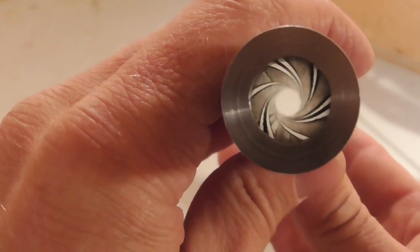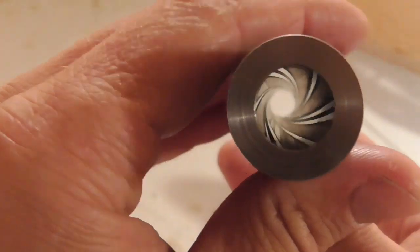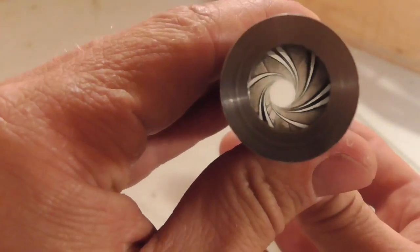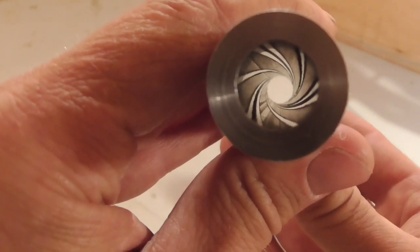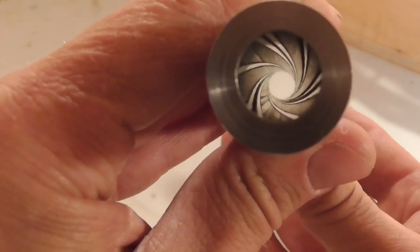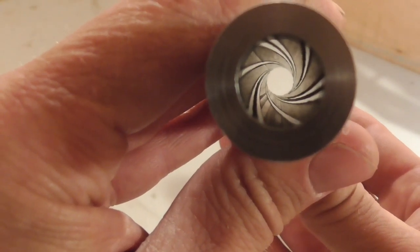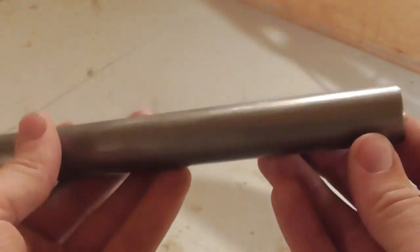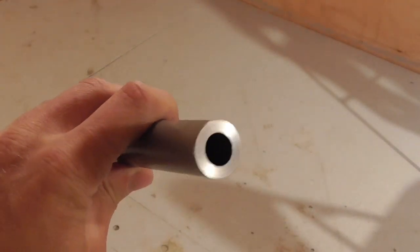And there is a nicely rifled barrel. I ran the button through three times for a total of nine grooves. I ended up getting the spacing a little bit non-uniform, so two sets of grooves came out real close together. But it actually looks kind of artistic and I expect it will work just fine. The next step will be to plug one end and cut some threads on it so I can use it in the Utah pistol, but we'll save that for a future episode. So until next time, thanks for watching the Idahoan Show.